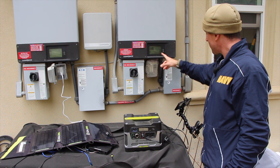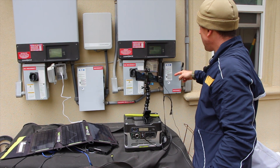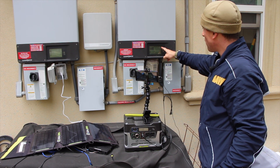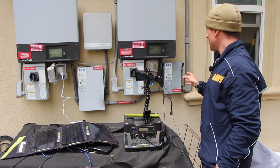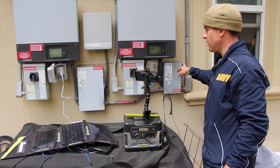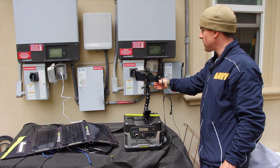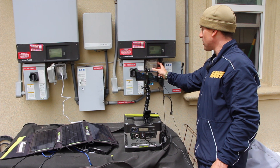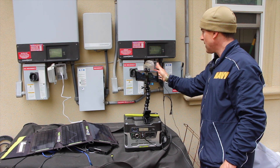And now we're going to wait. It's going to click over a few times, go through its cycle, and you'll start to see the wattage come back from zero up to whatever your panels are rated at. Make sure this stays on — this is your general duty safety switch. Again, your DC disconnect — you never had to do anything with that, so that should just be in a vertical on position — and your SPS, your secure power supply, make sure that is off.